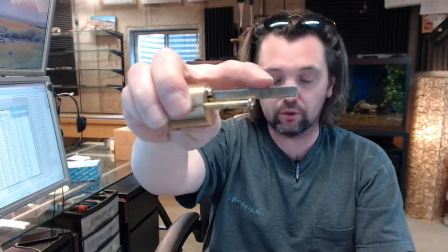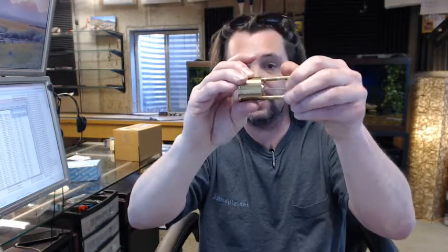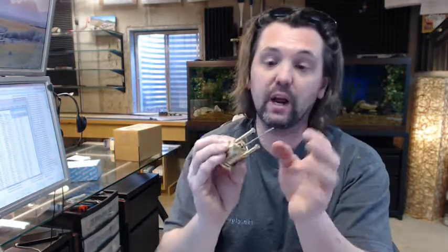Pliers and a hacksaw are needed because you have to modify the length of the tail piece and the screws based on your door thickness. The material comes long to accommodate doors up to 2-3/8 inches thick. For the most common 1-3/4 inch door, cut the tail piece down to the B line — the middle of three lines. For the screws, break them off at the first break, which is the Y break. You'll want to carefully cut these in a vise; the tail piece must remain perfectly straight to work correctly.